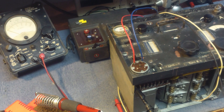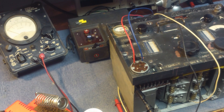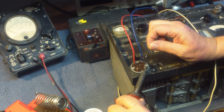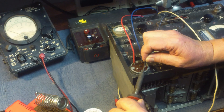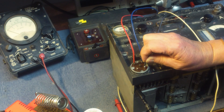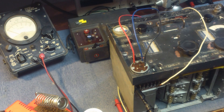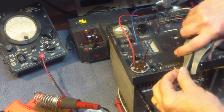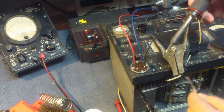Let's look at the plug - we have this one all cleaned off and we'll go ahead and attach some of the wires to it. Trying to keep the wires the same color as the inputs on the inverter, so the red and blue are your filament windings. The black wire will be the A minus wire. Go ahead and clean the iron and use wire strippers while you're doing things like tinning them.